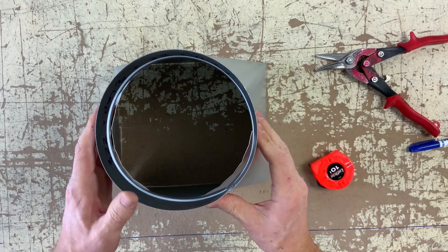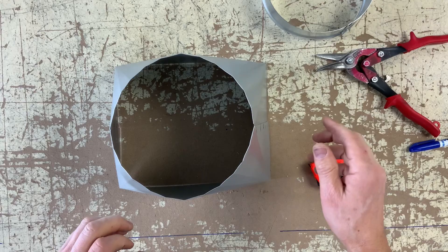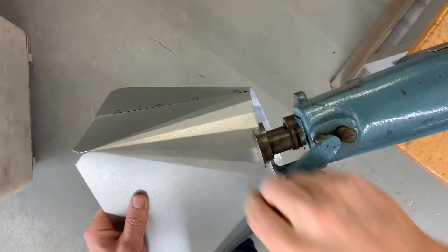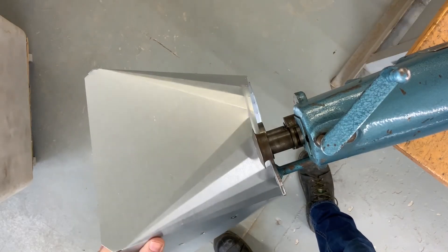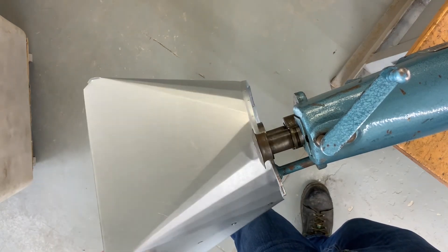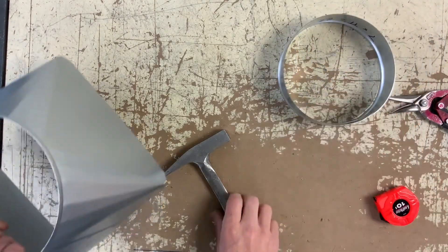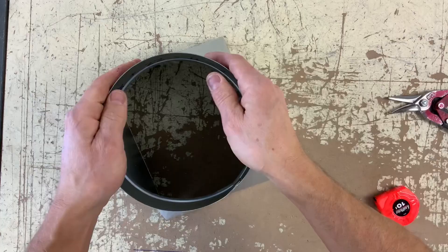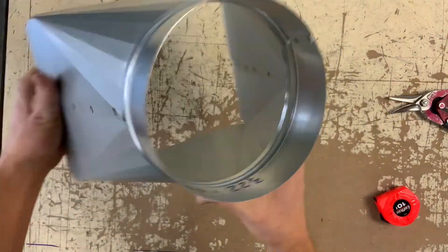Try it on the top — here I notice that it doesn't automatically fit in. A little bit of prep is required to make this collar fit inside the square-to-round, so I have chosen to go to the rotary machine. You can see the metal circle expanding a bit, just enough to get the collar in. Now she is ready for spot welding.